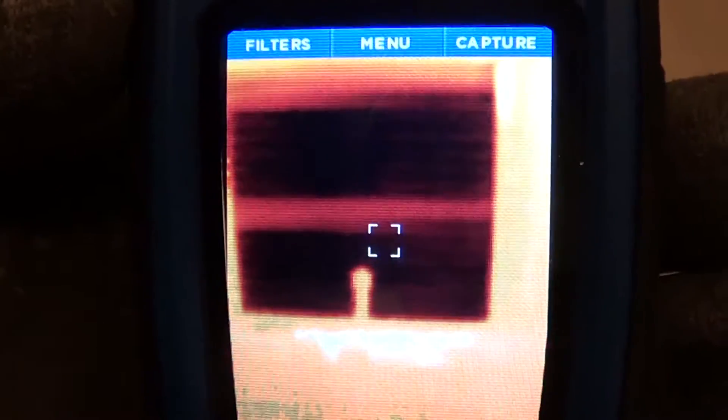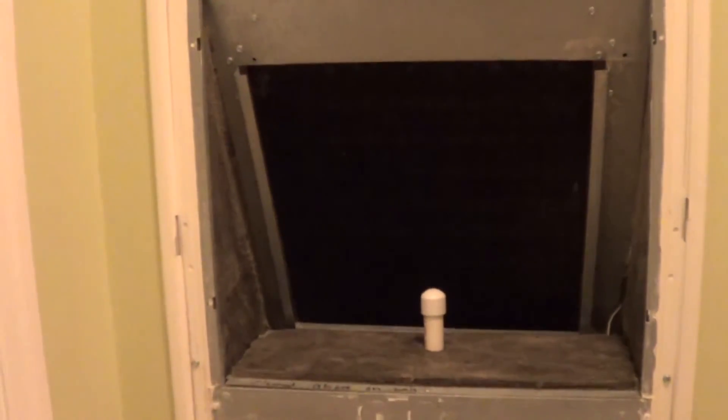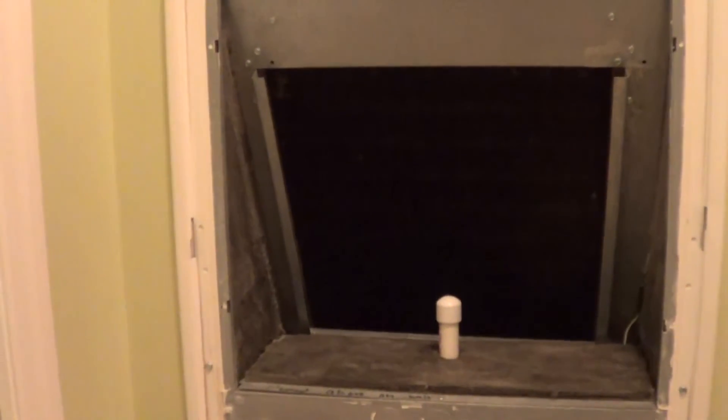The bulb was on really tight on the pipe, and so just after what looks like a couple of minutes, it basically stabilized. Now we've got our superheat on the top of both circuits and the system is stable. Pretty neat — you can see it in the thermal spectrum.